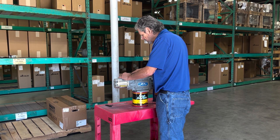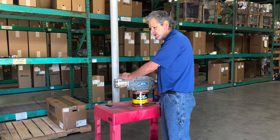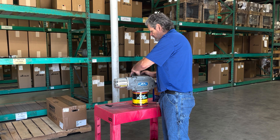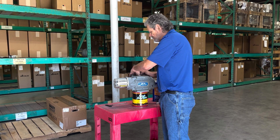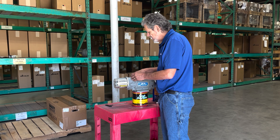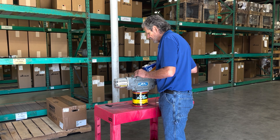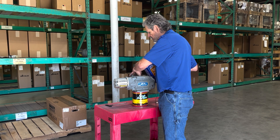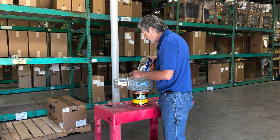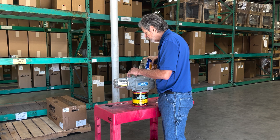At this time the fluid is going to start cleaning any debris off of the impellers. Do not under any circumstances use a sharp instrument such as a screwdriver to try to free up your impellers — this will cause damage. These impellers are made out of aluminum and it will score them or create some other issue. As you work the impellers back and forth, you will see that just adding this fluid will turn the impellers once they are free. If they are not free, keep working them back and forth.